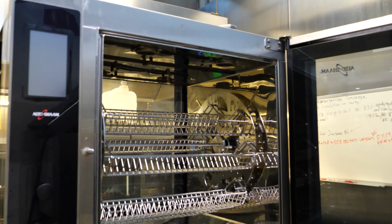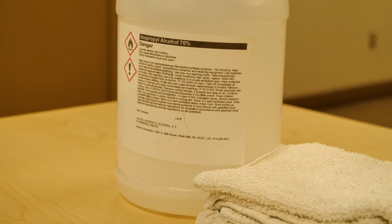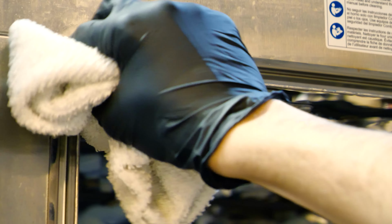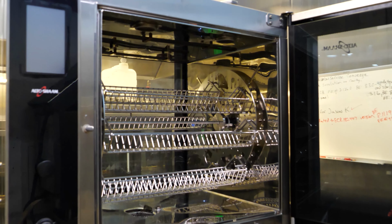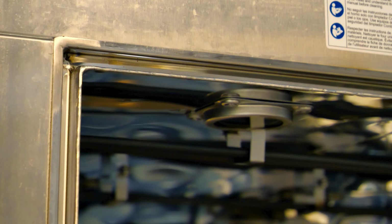Clean out the gasket channel thoroughly of all grease and debris using a towel and isopropyl alcohol. If there is any glue or silicone holding the channel in place, remove it. Then, inspect the channel for any dents, cracks, or debris that would prevent the gasket from forming a tight seal. It must be clean and clear of all grease before the gasket is installed.